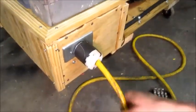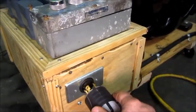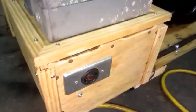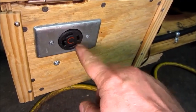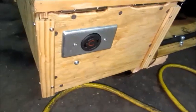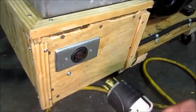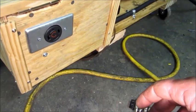Since the last video I hadn't shown the output outlet I put on here. It's the same style as my other converter. The only thing that ever gets plugged in is this test cord. I think this outlet really is not intended for three-phase — I believe it's meant for a dedicated neutral, with single-phase two lives and the neutral and ground separate. I like to physically disconnect this before I handle the wiring instead of trying to trust the contactor.